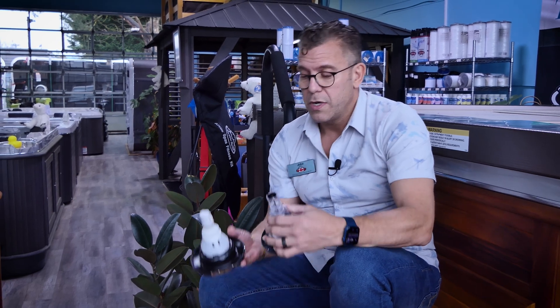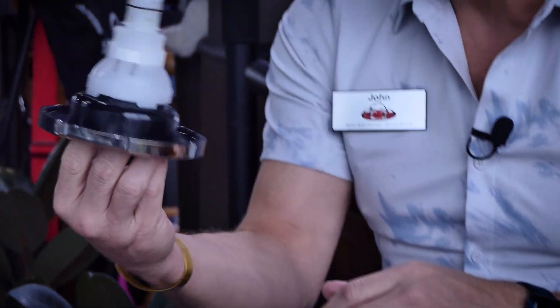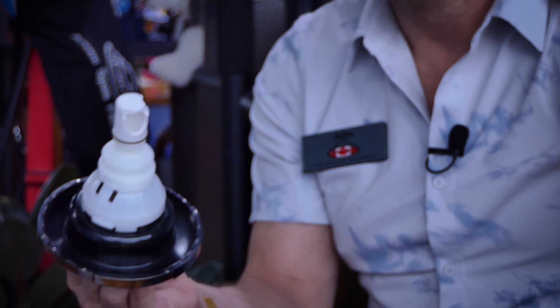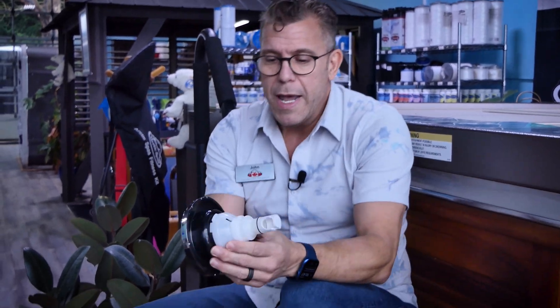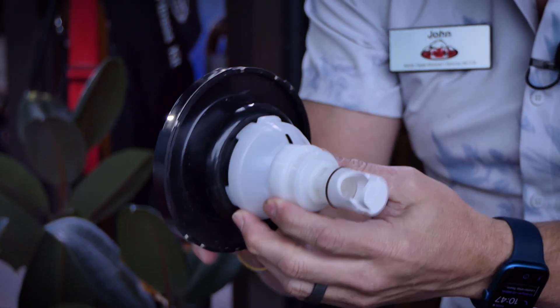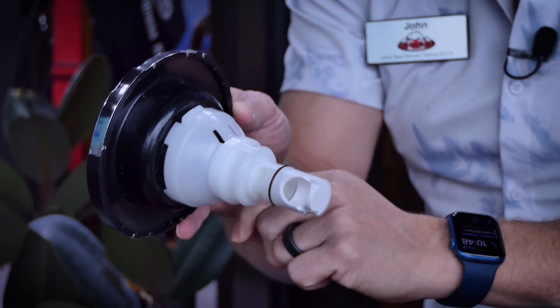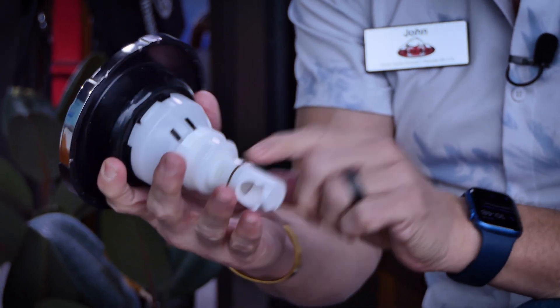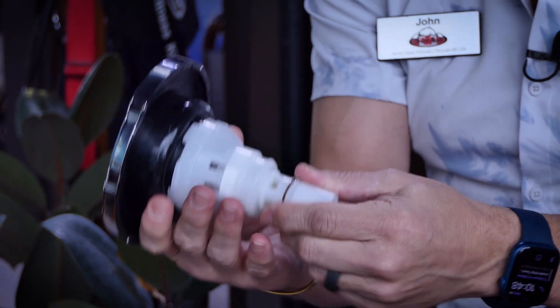The first thing obviously with anything that you build is the raw materials that you use. You can see on this particular jet — this is a standard offering. I think this is a custom molded plastic. There's Waterways, and then we have our own private label one that we've had made by Rising Dragon, and I was on the engineering team that helped make this jet. This material here is POM — most likely it's POM. Could be — some companies use nylon, some companies use ABS. The fact is that this material over time with the water chemistry can get affected and oxidized.